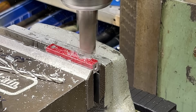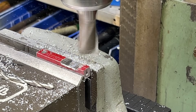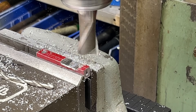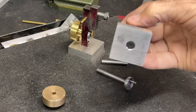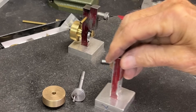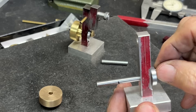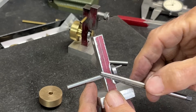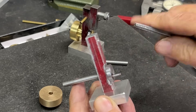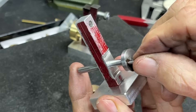Did you notice the extremely fine dust in the air from magnesium? I'm wondering if that is a hazard — should I be wearing a mask? I'm 80 years old, who cares! Okay, I'm progressing quite nicely. I've mounted the column onto the base, deburred it, and the main shaft fits in there nicely. You may have to do some fitting as you go along — I used a power reamer in the mill, but a little hand reamer took off a few thousandths and gave me a better fit on the top hole as well.